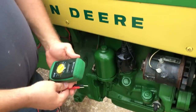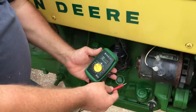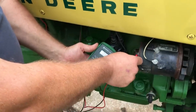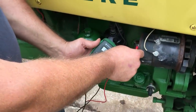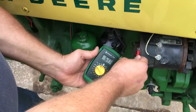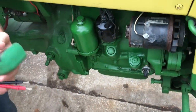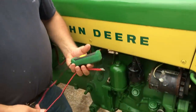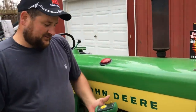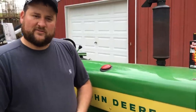In the situation with our 1959 model 430W John Deere tractor, we know it's a 6-volt system, positive ground, but we want to double-check that. Using a voltmeter, with positive to ground and the ignition switch turned on, I'm connecting to the wire that goes from the coil to the distributor — reading six point two eight volts. That confirms we have no ballast resistor in this system.